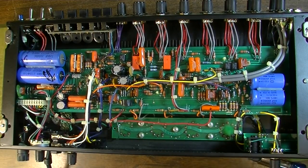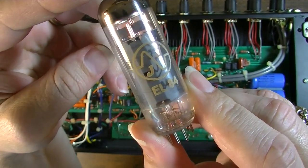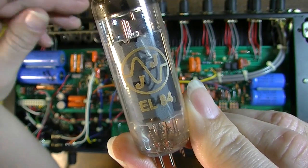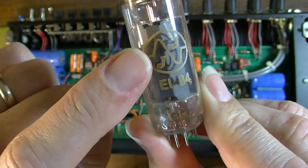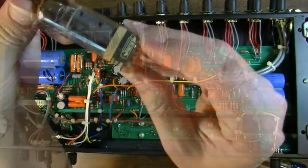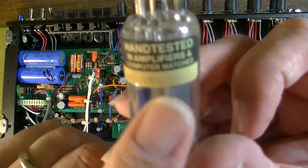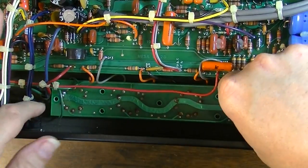Once this is done and everything is operating correctly, I mean, look at that. If these were new tubes, then this thing has been just cooking, because that doesn't happen. Usually, if the amp is running correctly, it takes a long time for JJs to go this yellow. I mean, just washed out color. And yeah, see just the nicotine stain cooked look of this yellowed paper. That would have been like bone white originally.